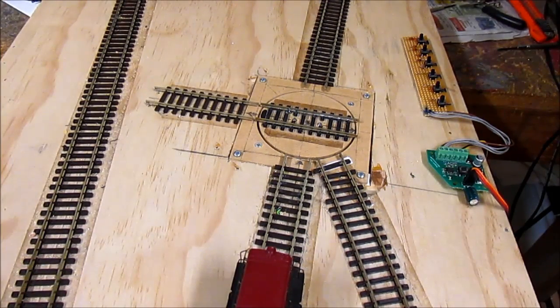When the power is turned off the servo will stay where it is, and when we turn the power back on it will do a small backlash correction and then drive to the original position, which in this case was track two that was last used. So it always remembers the last position it was in, stops the servo going berserk, and does a little backlash correction.